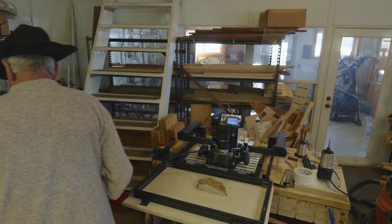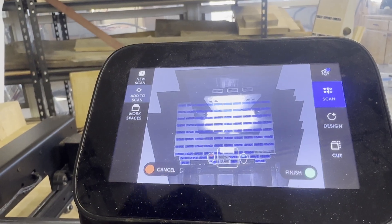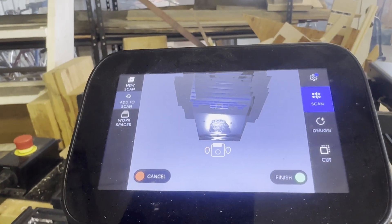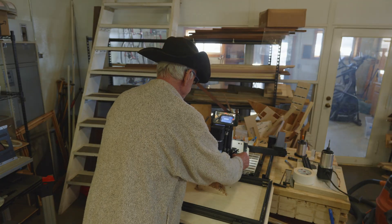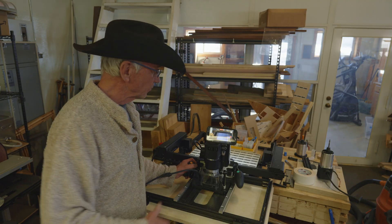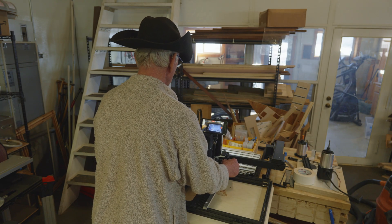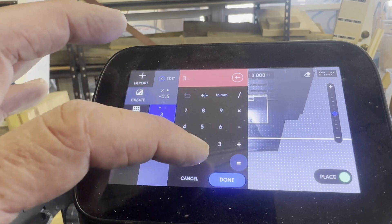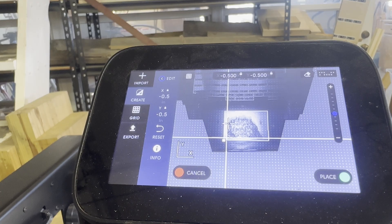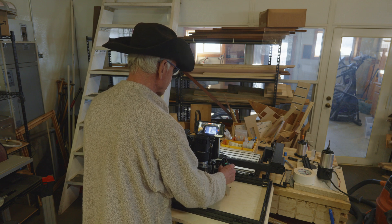Down on screen you'll see an image of the sled rather than an image of the workpiece — that's fine, you can grid it and cut away without seeing an image of what you're cutting. But sometimes it's nice to see the workpiece, so you unclip from BenchPilot, get the sled out, and do an 'add to scan' moving it out until you can see the piece of wood. Now you've got the usual image of the wood. Then just grid as per normal — say it's seven and a half by five inches, so I'll make an eight by six rectangle, anchor it, and place it to cover the entire piece of burl.